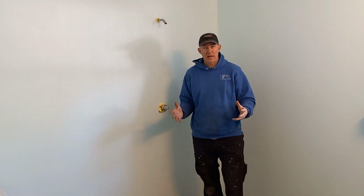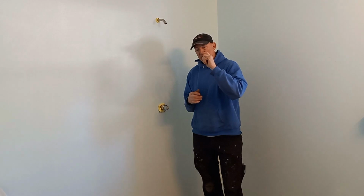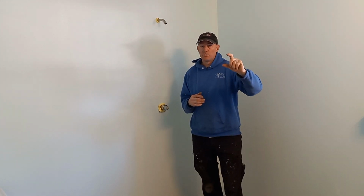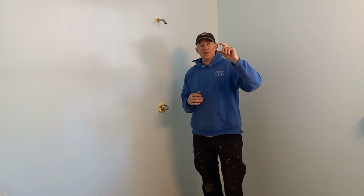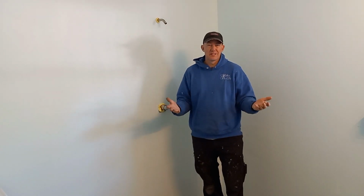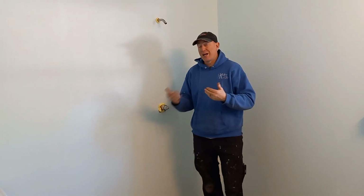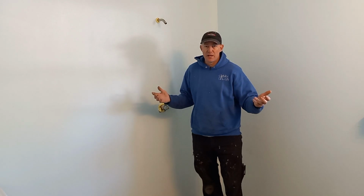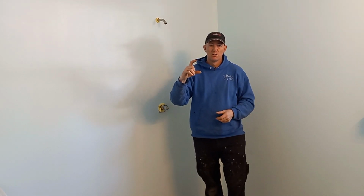That way nothing cracks. So an inch and a half thick at the drain plus 3/8 of an inch is almost 2 inches. Then you have the height of your curb to keep water from spilling out. You want at least a 2 inch, I'm thinking. That's how I come up with it. How somebody else comes up with it is kind of up to them. But that's why it's 4 inches tall.